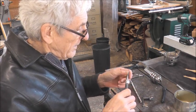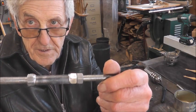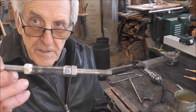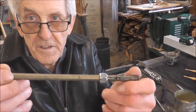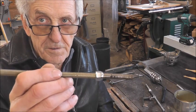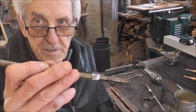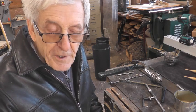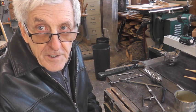The next thing is to put a spacer in here — a piece of pipe. You could even make one out of a little piece of wood with a hole drilled through it, but it'd be nice to find a piece of pipe. This is three-eighths here, but any type of spacer will do. If you had a longer mandrel, you could put two or three ornaments on there. I don't know if I'd go beyond three, but if Cade could do it with a pen mandrel with three on there, you could put three on the three-eighths arbor. For practical purposes, I think I'm just going to make another one with one on there — get a little piece of pipe, hacksaw it off, and start assembling.